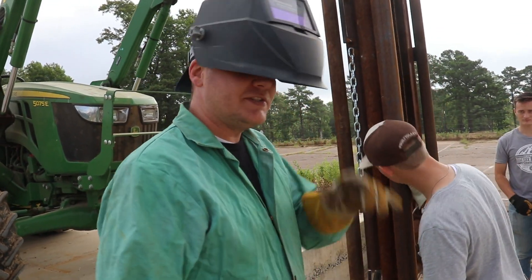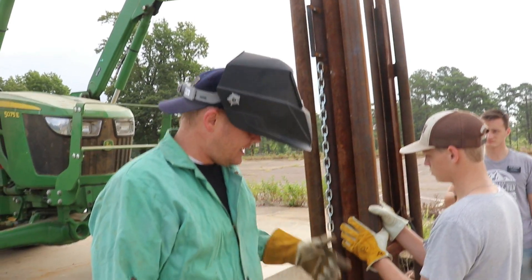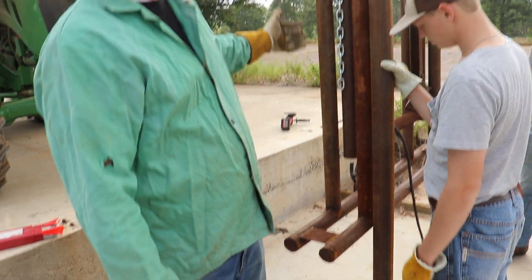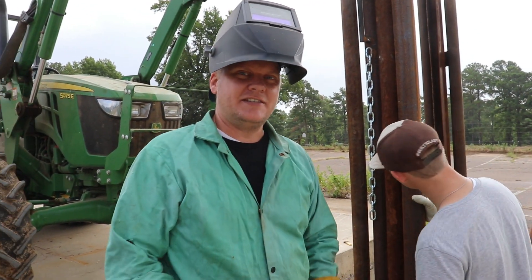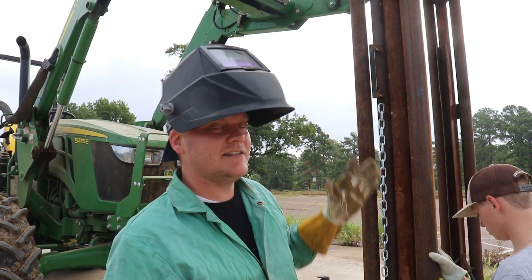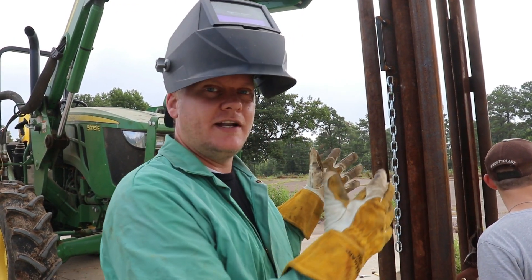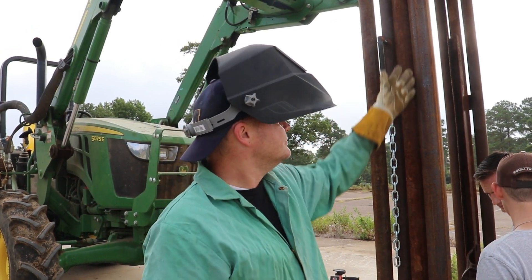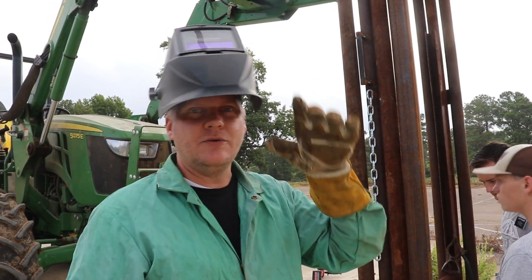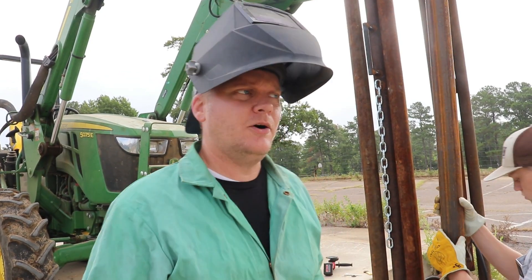Nothing wrong, except the welding. Alright, so this is the beauty — this is what's happening. Dark helmet. We're just laying this guy right up front. We're going to be putting a post, and eventually we'll put one on the back end. So we're just going to be welding these guys together right down the seam, probably from both sides. Initially I'm just going to tack this up — just get it set so it holds. Once I have all four kind of on, I can lay this down on the ground and finish a lot of the welds. I may not do a whole bead all the way through, but I'm going to do enough that it actually holds. At least that's my hope.